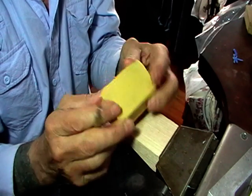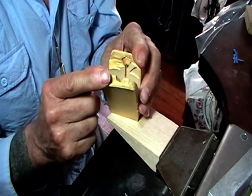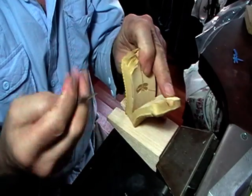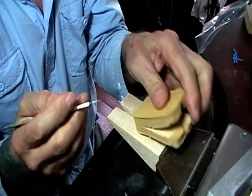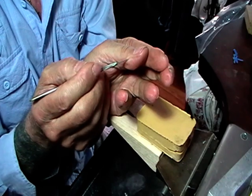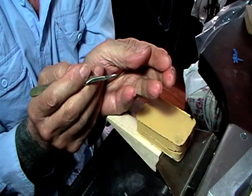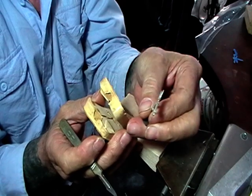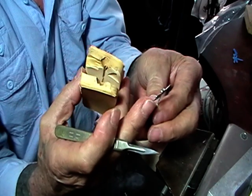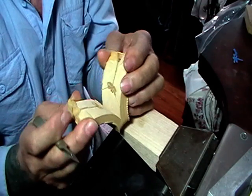So that's it — our vulcanized mold. Now, this is the quick and dirty version. If you have something that is more complicated and your parting line — which is the line where your mold comes apart — is critical, you'd want to cut that by hand so that you would know exactly where the line is on your master for minimum cleanup. But for something like this that's just a flat, two-dimensional surface, it doesn't matter. The parting line will be right on the edge all the way around. This is the quick way to do it.